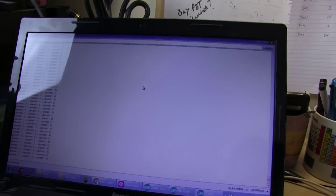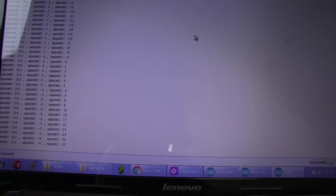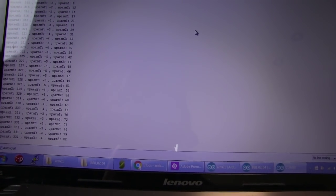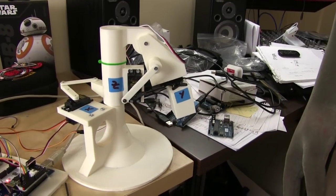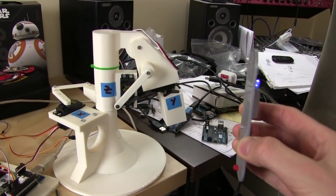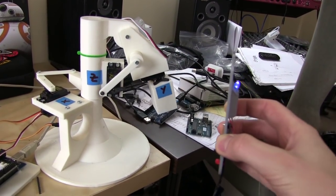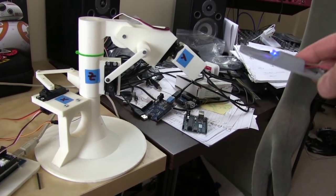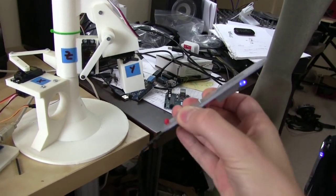So if I go and grab that sensor and tilt it around, we should see the last one, which is upper arm Z, moving between approximately 0, it does go further if I move it further, and all the way down to 90. Okay, and you may be able to hear in the background the arm is actually attached to that as well. So now I've got my Z axis operating from that Z axis on the arm. It is constrained because it can't physically move any further, so if I keep moving nothing happens.